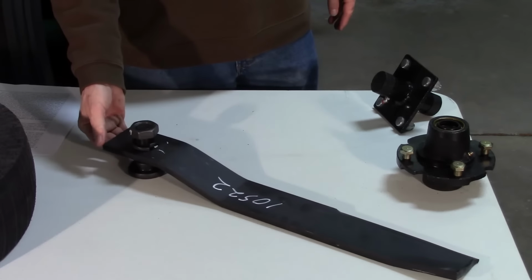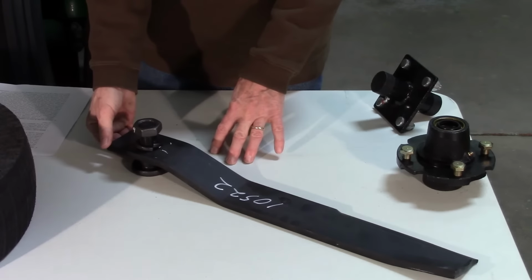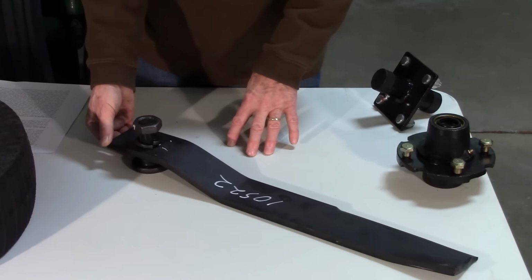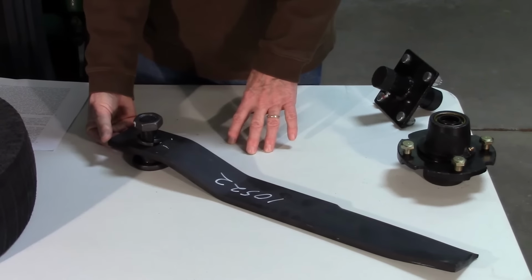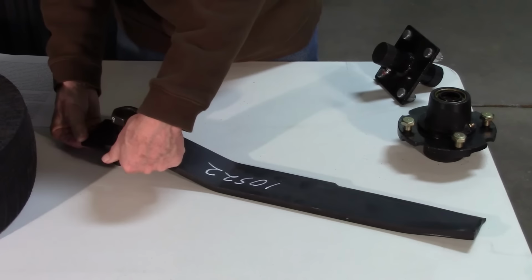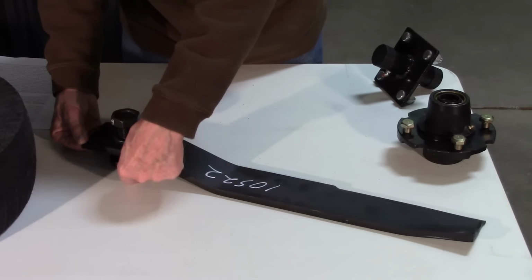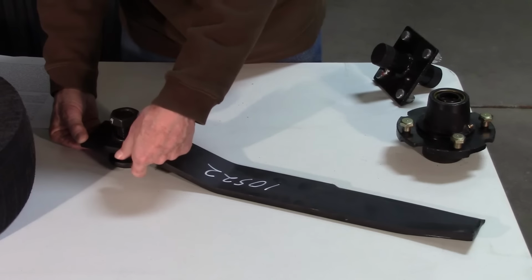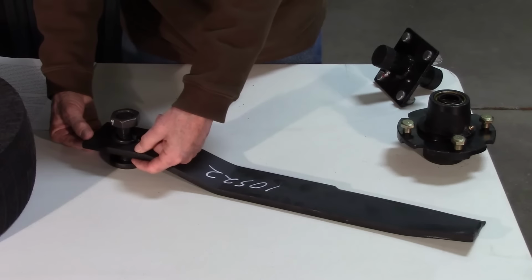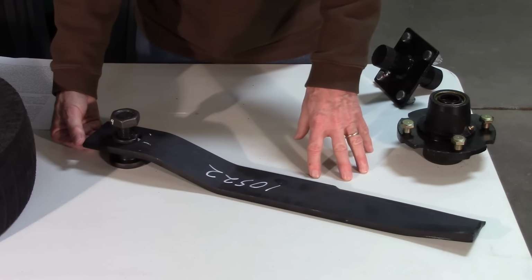Now there's also what's known as the offset or rise or drop or whatever you want to call it, and that's part of what your height adjustment's all about. There's no adjusting this. It is what it is. So be sure that you've got enough room on these. Most of them, when you measure them, are going to be approximately 2 inch, and you're measuring from the ground level here to the underside of the blade. Now you will see some people measuring from the ground to the top of this, but if this is the same, then the other part, assuming you know the thickness of your blades, 1/2 inch or 3/8 or whatever it is, is going to be all right. But all this is doing is setting the height that the blade is going to be cutting in the ground.